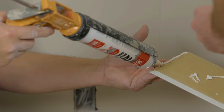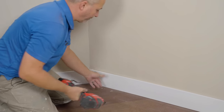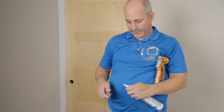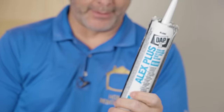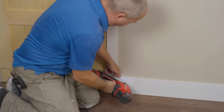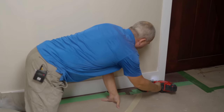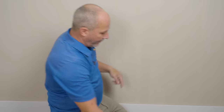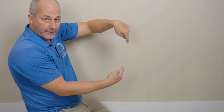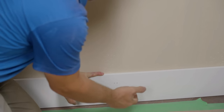Here's how you make a perfect miter joint. We're going to finish nailing this on in just a second, but I've got a couple more tricks to show you. We're cutting this on a bit of a 45-degree angle and starting with a small hole — and if we need to, we can always make this hole bigger. Now you'll notice this part of the baseboard is sitting a little bit flush. If you're using green board for soundproofing and then drywall, you don't know if you have contact — so put the nails in on angles so that it's creating a pinch and that'll keep the board in place. Because it's MDF, it has a little bit of flexibility, so shoot down here and up here a couple of times and it'll give it some resistance and that should hold it in place.